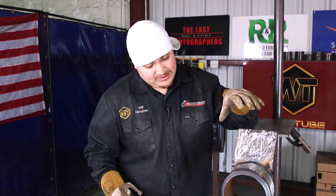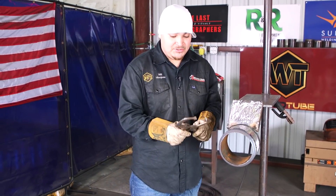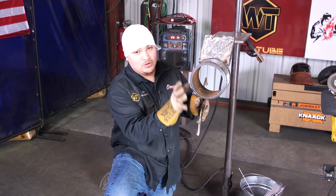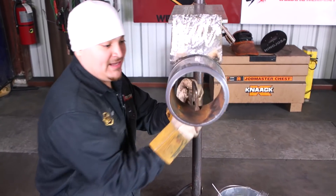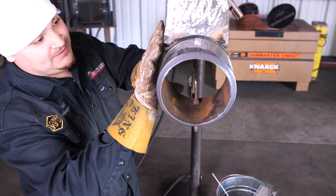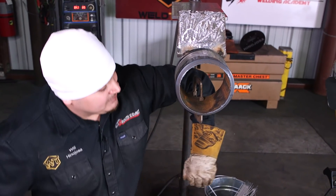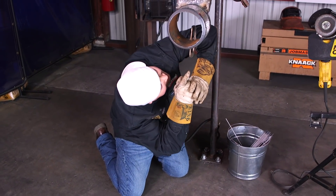For the beginners, I know you might be uncomfortable when you're welding pipes, so I'm going to show you how to position yourself using this C-clamp. What I like to do when I'm welding 5G on a pipe coupon is clamp it here at six o'clock. That gives me a nice prop as if there was a long pipe here. I use the inner part of my elbow, just like this, to hold myself up. This clamp allows me to hold my body weight as I'm welding and lets me get up nice and close.